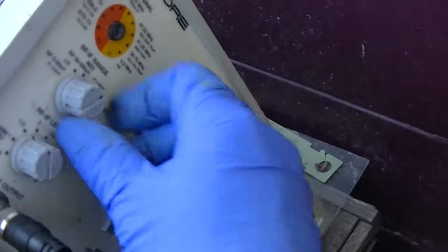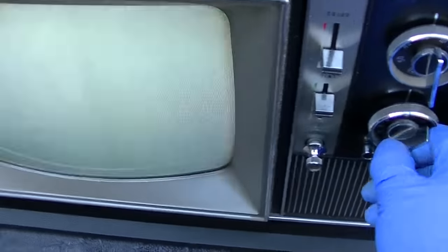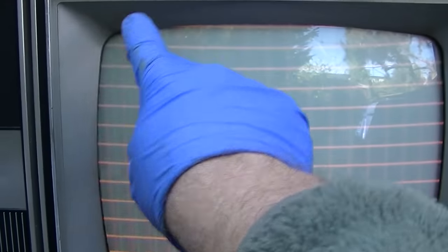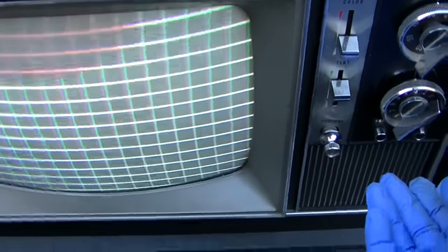I kind of got this loose — it's just dried grease, like in a record player. But before I go and totally disassemble this TV, which I'm kind of reluctant to do because it's so complicated, I want to have a look at the convergence. Wow, look at the convergence — it's whacked. Down in this corner it's really good, but it's just trash in this other area. That's almost like a bad component. The fine tuning works — it's almost like it's got AFC on it too.